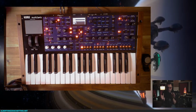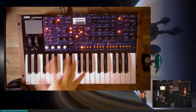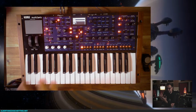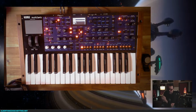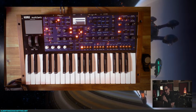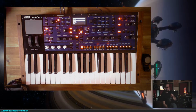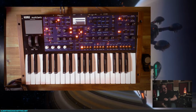Now, the oscillators are certainly part of why a synth sounds the way it sounds. The MS-20 sawtooth doesn't sound like the Minimoog sawtooth. The filters are a huge part, but a lot of the time you have a completely linear VCA, whereas the old units were not linear in the VCA, and that little bit of variation, especially when pushed, gives you that. So, I'm gonna play this D key again because we're gonna get washed by reverb, okay? Ready?